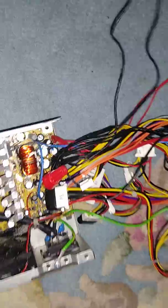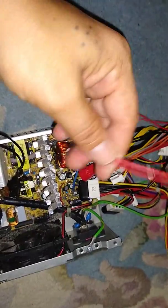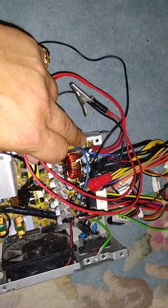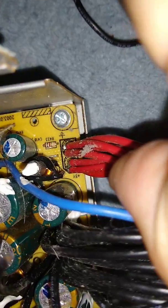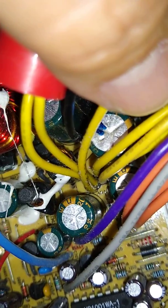As far as these wires here, I've already done it with this one. I needed two because this was going to be a power source for a chlorate cell. I used two ground wires and two of the five-volt 20-amp wires, because that's what this power source is rated for. I separated out two from the rest. If you look on it, it says right there what it is.